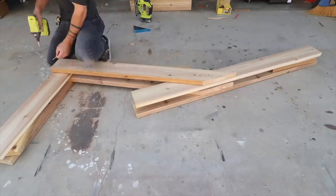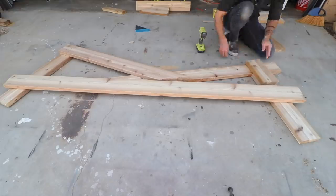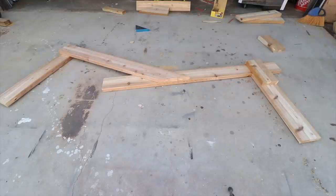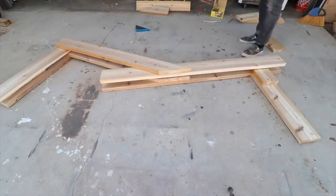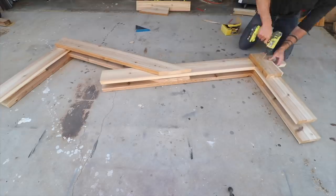I'm basically just making two identical trusses that fit right on the peak of the roof, so whatever I do to one, I do to the other. The trick is in managing the layers, so for the 90 degree piece on the other side I have to use a short scrap piece as a connector. This way it'll keep my top piece, which will support the flat part of the deck, on top of the two 90 degree angled pieces.